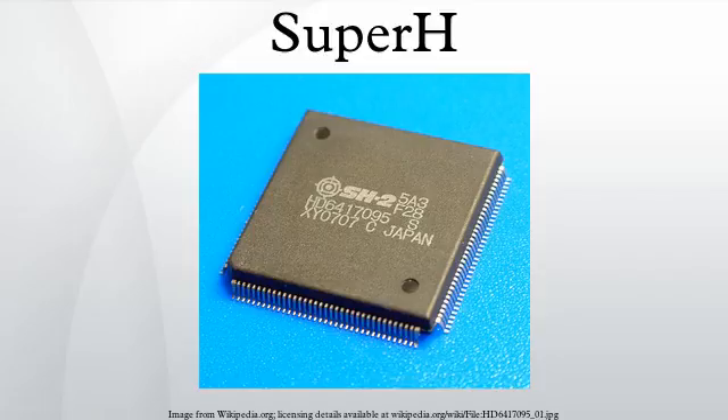The SH2-A is an upgrade to the SH2 core, announced in early 2006. At launch in 2007, the SH2-A-based SH7211 was the world's fastest embedded flash microcontroller running at 160 MHz. It was later superseded by several newer SuperH devices running at up to 200 MHz. New features on the SH2-A core include superscalar architecture, execution of two instructions simultaneously, Harvard architecture, two five-stage pipelines, and 15 register banks for interrupt response in six cycles.